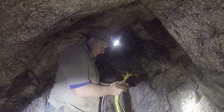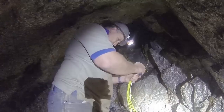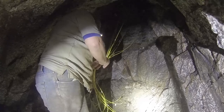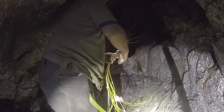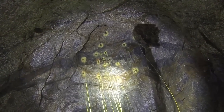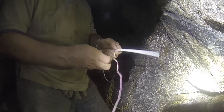We'll wrap it around, and then we'll wrap it in tape. This will set off all the shock tube, and then we'll tape an electric det onto it. This is an explosive charge, and this will explode, sending the shockwave right up through all these non-el cords here. All the holes are charged up now with all the non-el dets coming out of them. This is a zero det, so instantaneous. I'm just taping on to the shock tube of the det cord.